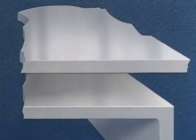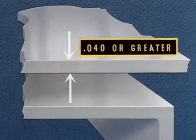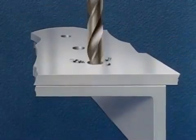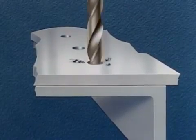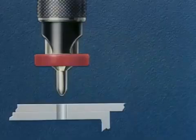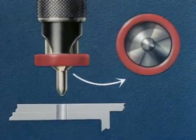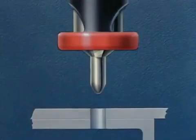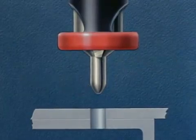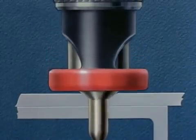Probably the best production method involves sheets of 40 thousandths thickness or greater. We start with the assembly of the sheets, drilling the correct size hole for the given rivet. We're using a one-eighth inch rivet, so we drill a number 30 hole, then countersink using a special countersinking tool with a two flute cutter, a 100 degree cutting angle, and a number 30 pilot. Unless specific approval has been obtained from the stress engineer, the countersinking should not go through the first sheet.